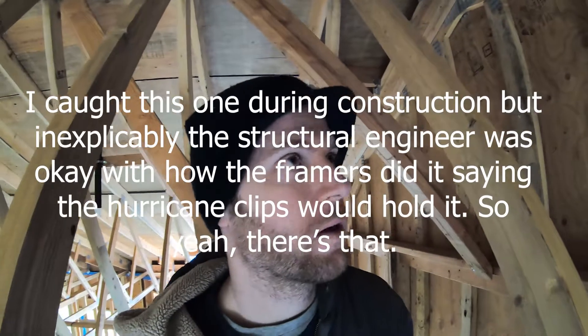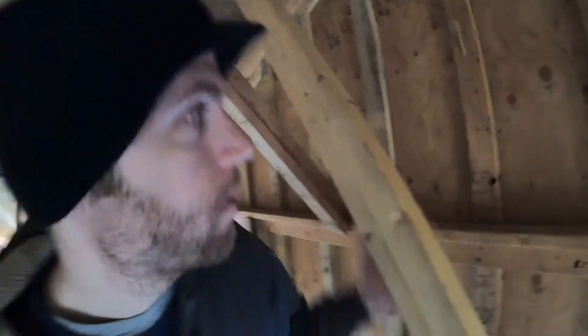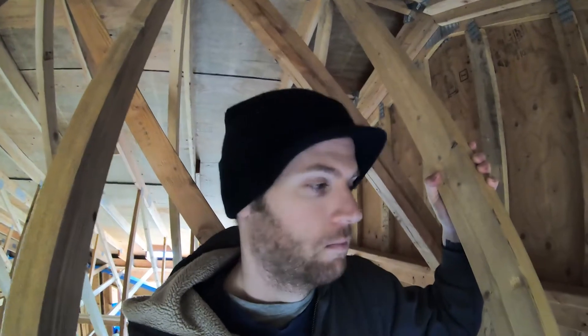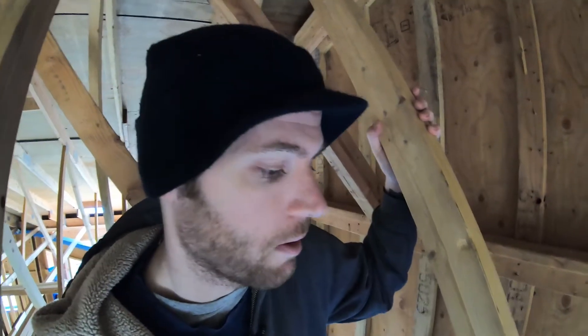This is just what happens on job sites. If you're not there really checking things out, things will get missed. The inspector would never have really checked this — it's required for super high wind loads because we're within about 600 feet of the coastline. You have really serious wind loads on this house, and that definitely would not have met it — but it would have just gone through and been passed, and no one would have known until it tore off.